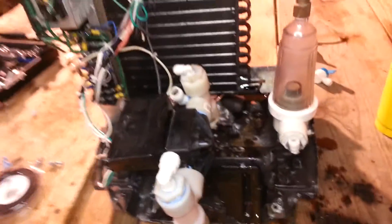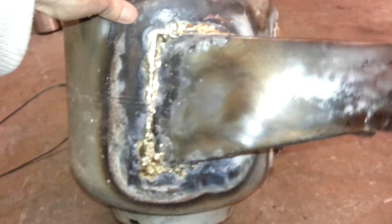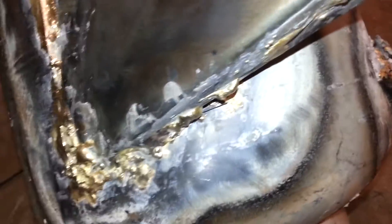This thing's got some issues. I got this thing taken apart because, as I said, I was brazing this device here together with it. I managed to get these brazed on, but those vents kept clogging up on me for what I was using, so I had to put this new unit on. During the process of brazing that — which did very well as far as how hot it was getting — the brazing did flow a little better than over here. This is map gas only, and you can see how clumpy that is. Just wasn't getting the heat I needed. I need to get a good setup.